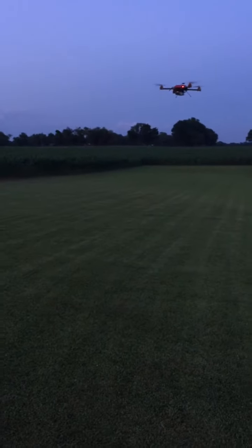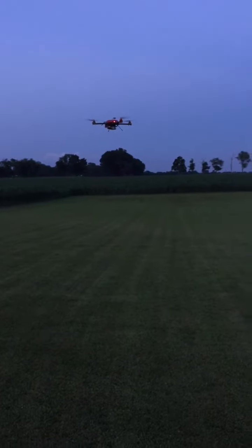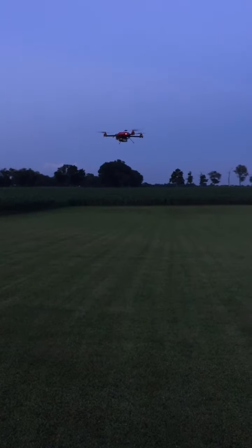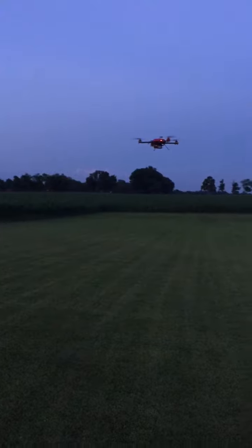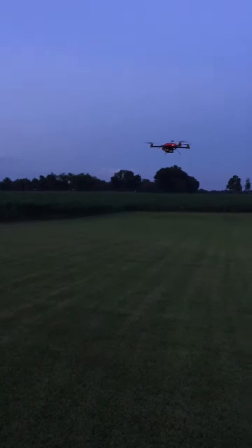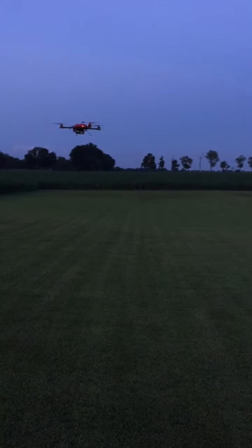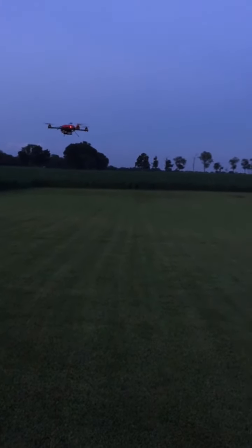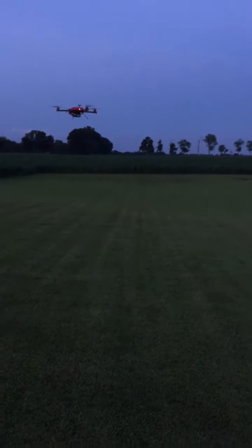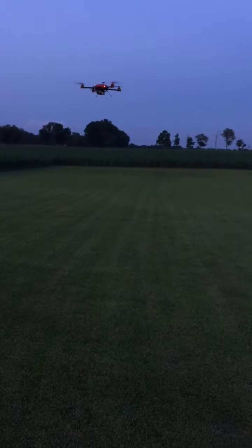So what size pack? That's like those batteries, 12 cells? Those are 4 cells, like 4S. Yes, it's a 4S, and it's a 16,000 milliamp battery. You said you're getting 52 volts? No, 51%. I'm halfway. And I just did 18 minutes. Oh, I see, the voltage is below. Yes.